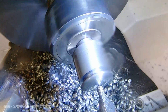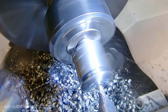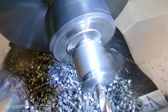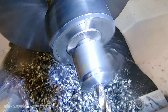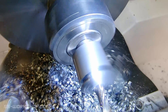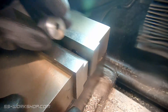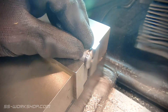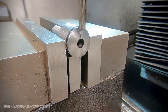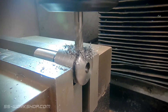With the desired material removed, I drill the part — this hole will form part of the coupler's shape — shortly, when I head over to the mill and machine a slot into it. For the slot, I'm using a 6mm end mill, making the cut in several passes.